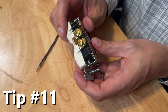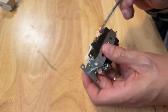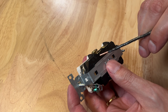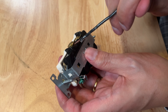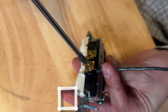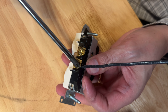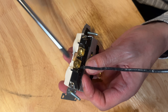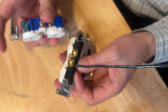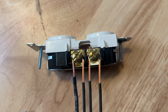Now if you upgrade to better outlets, you don't have to worry about the J-hook and the screw. You actually have these little pressure plates — that makes your life a lot easier. With the side wiring option, you do not have to bend the wire at all. They can just go straight in under the pressure plates and when you tighten them down you're good to go. In this application you can put two wires per plate — four wires total — whereas the cheap outlet only allows two wires per side.